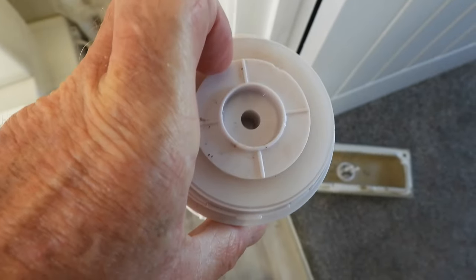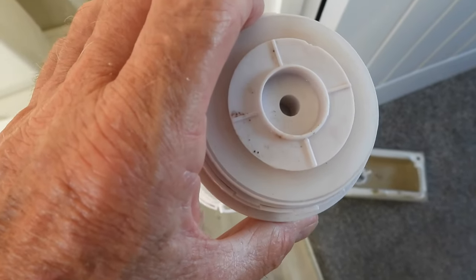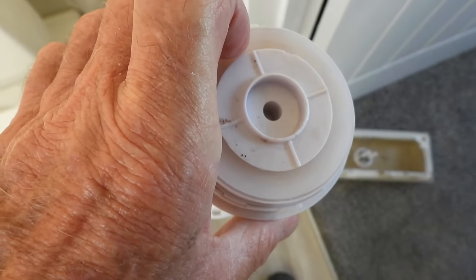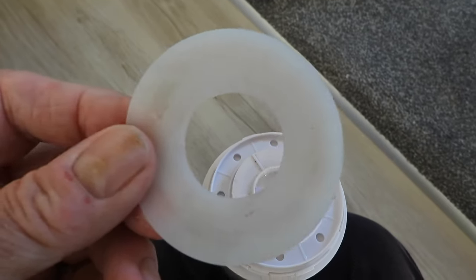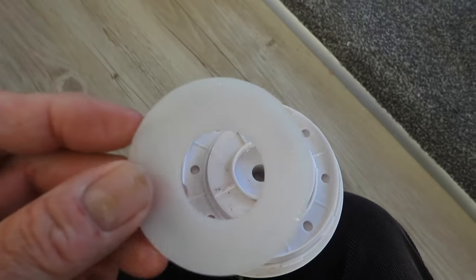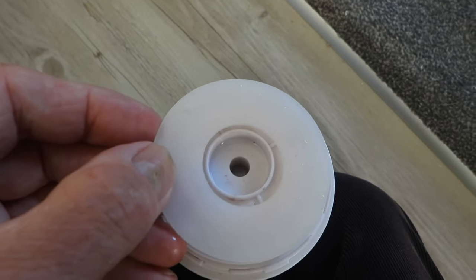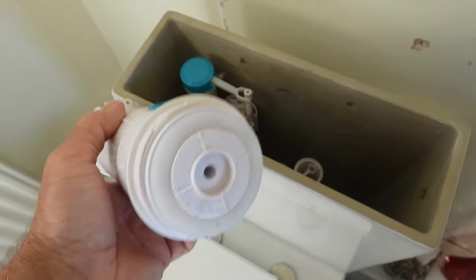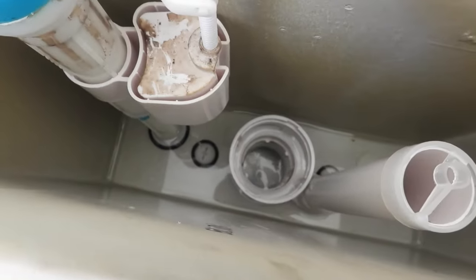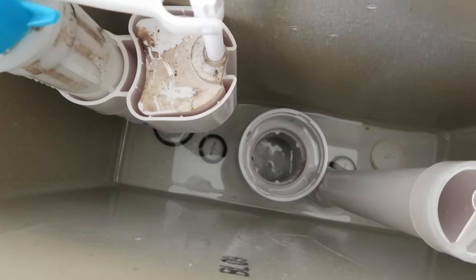What we're going to do is reverse this washer around the other way — flip it upside down. You can get a new washer if you want, but a lot of times a quick flip over will do the trick. I'll whisk the washer off and turn it around the other way. That's what it looks like with it off. I'm going to flip it over — normally that does it. If it doesn't, you'll need a replacement washer. Make sure the seat in there is clean with no debris before fitting it back, or the washer won't seal properly.